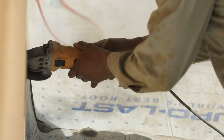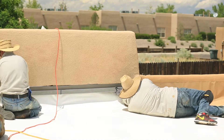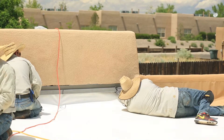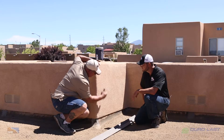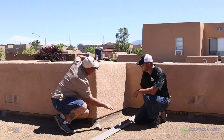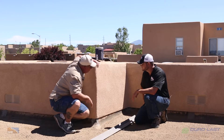We're going to take the grinder and cut this stucco off. Then we're going to install the reglet and the roofing with the paper, counter flashing it correctly, so that any water that gets behind this stucco can then shed out over the metal and on top of the roof and not behind it. And that's what we're trying to accomplish.